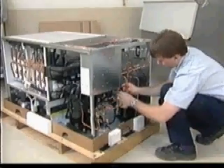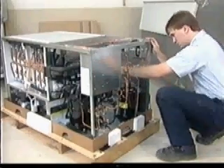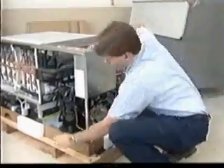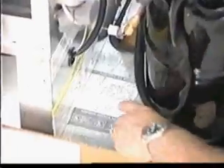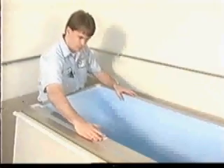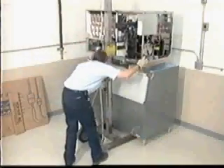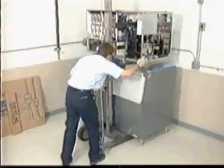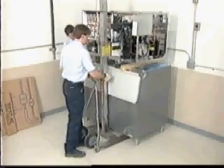Now check to see that the refrigerant lines do not rub or touch other lines or surfaces. On air-cooled units, be sure that the fan blade turns freely. Check that the compressor is snug on all mounting pads. Finally, check the nameplate to make sure that your electrical service is the same as the voltage specified. The gasket provided with Hoshizaki bins provides an adequate seal between the two units. Place the ice maker on the top of the storage bin and secure it using the two mounting brackets and four bolts provided.